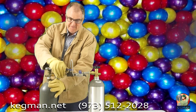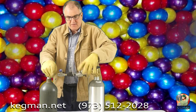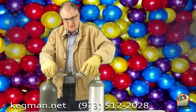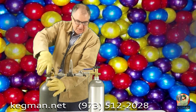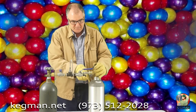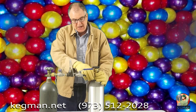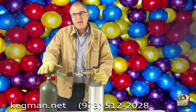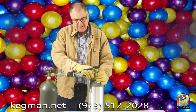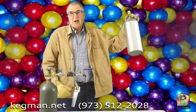Turn it to off and vent the gas — just a quick little shot. That's open, this is closed, this is closed. Remember, for demonstration purposes only we didn't use a scale, but we recommend using a scale. Again, this source tank is going to be much larger than your receiving tank — we're just doing this for the video. So now you've transferred gas and you're ready to go.